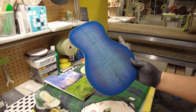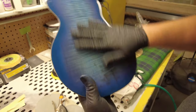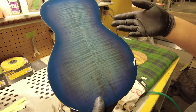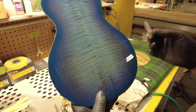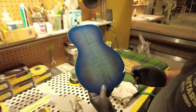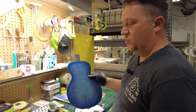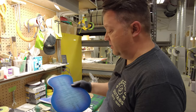So that's what you were just working on, and that has a high gloss finish. It's gone through the sealer stage, then we sand it and do a top coat — and it's a very thin finish too, which helps with our sound. The more finish you put on, the worse it's going to sound. So we try to put on as little as we can and still be able to work with it.